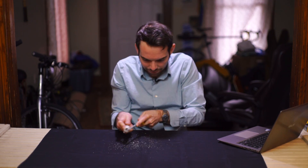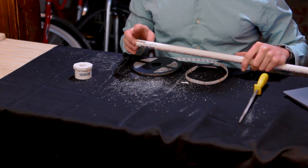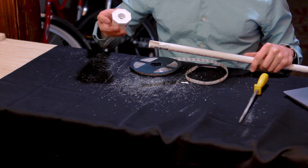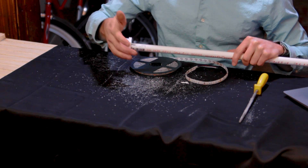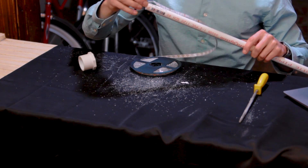File out a notch. To find the appropriate depth for the notch, take your one-and-a-half inch to half-inch PVC bushing and put it on the end. You want to ensure that you have sufficient room through which you can feed the wires that are coming off the LED strip.